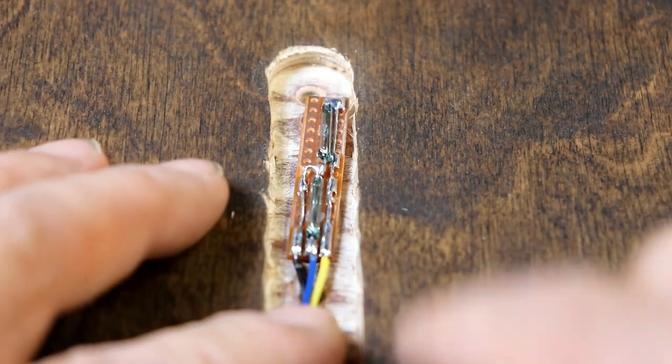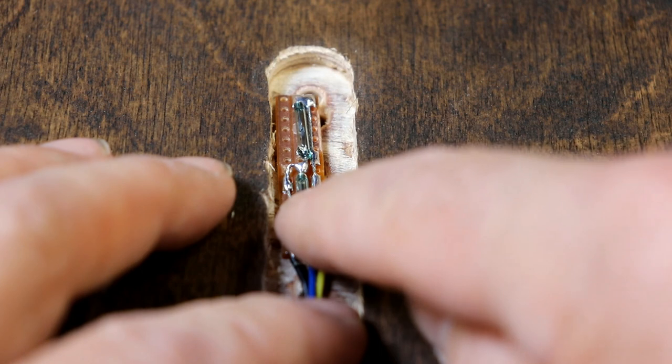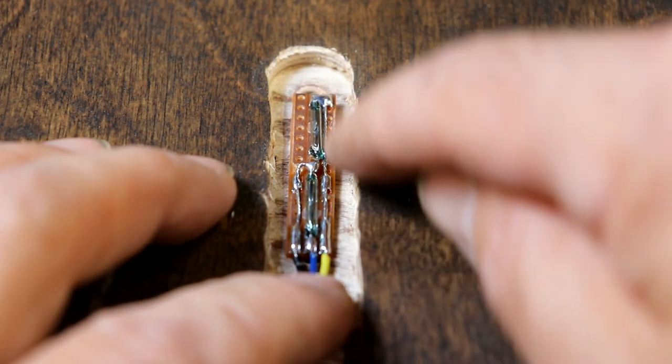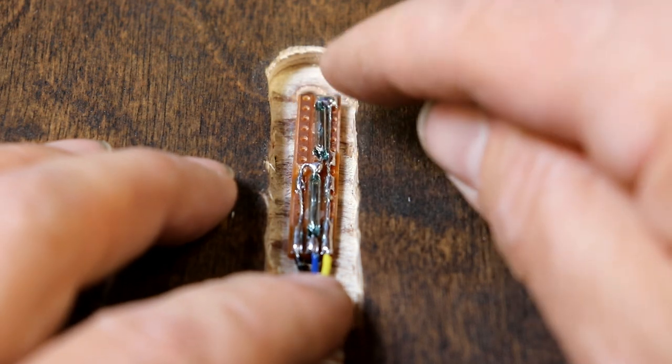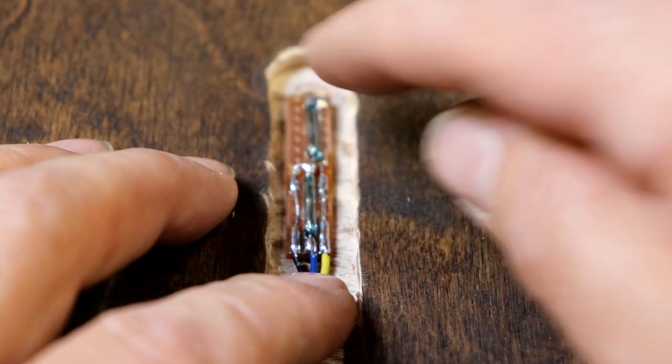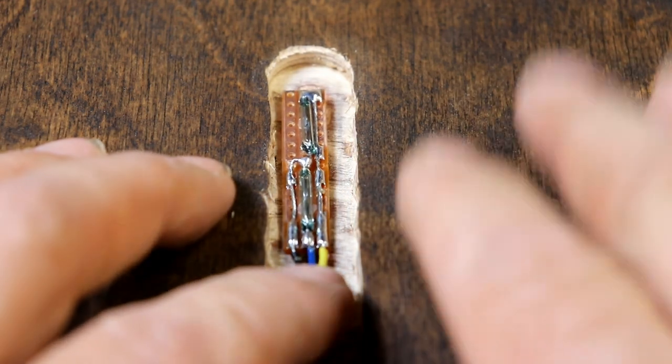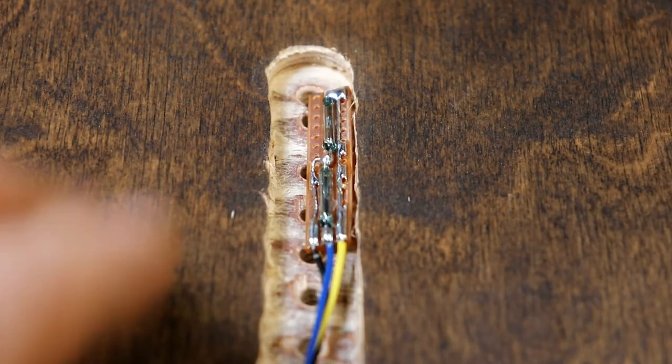So in the end, when I started making them for other people, I've put the five magnets on, one of which is centred a little bit close to the centre, which tells the Arduino where it is, and then the other one tells it when it's lined up with each scene. It's just better feedback, so it knows exactly where to stop it.